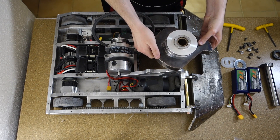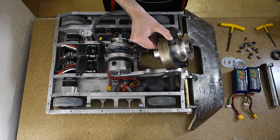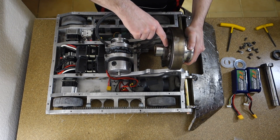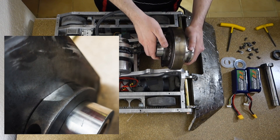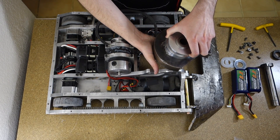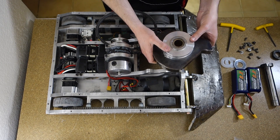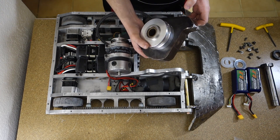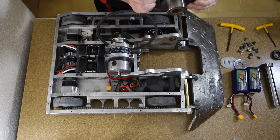The pulley is held on by two pretty large set screws that clamp down on the shaft collar. The key detail is that the shaft collar has a beveled flat sloping downward toward the blade, so as you tighten the set screw it sucks the pulley against the blade. It seems like a simple setup, but it's been through three competitions without a problem. This whole assembly weighs about 13–14 pounds, and the blade itself is only about 10 — still a pretty hefty chunk for a lightweight.